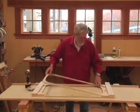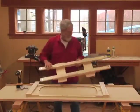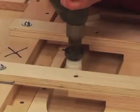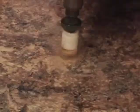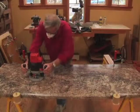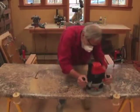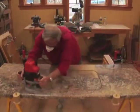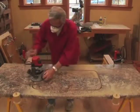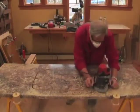Next, the hole routing jig is placed and secured. The center support jig holds the center slug to stabilize the routing operation. A starting hole is drilled first from the bottom of the countertop and then completed from the top. For the best possible appearance, it is critically important that the sinkhole be precise and chatter-free. This is best achieved by double routing. The second pass is done with a guide bearing that is one-eighth of an inch smaller in diameter, creating a precision-smooth interface.